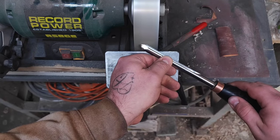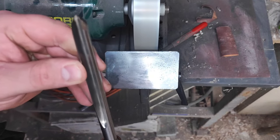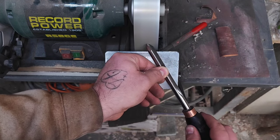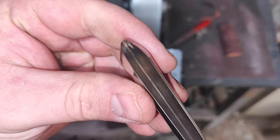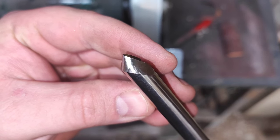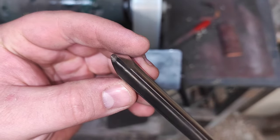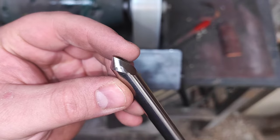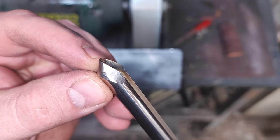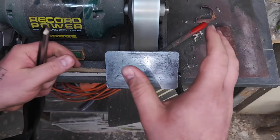Working on the other wing — a little bit more. Now this is nice and sharp — single bevel, pretty much single bevel all the way around — with a nice profile showing the outline of the parabolic flute. You have nice curves visible on the outline at the top, a nice slight curve on the wings which will allow for nice shear scraping. This tool will now work beautifully.